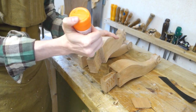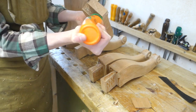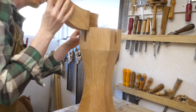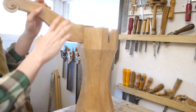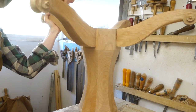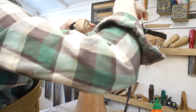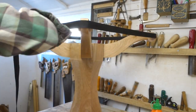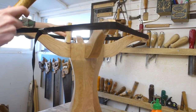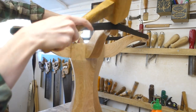So with that the legs are done, the column is done — let's get it assembled! I used polyurethane glue for this to make these large joints slide together more easily. You could probably leave it without clamps to be honest, but I always feel weird doing that so I put a strap around the legs to sort of hold them. With winding sticks I checked if the feet were level and when they were, I left it to dry.